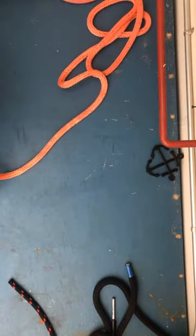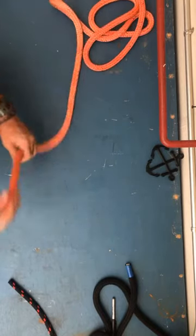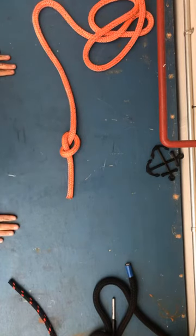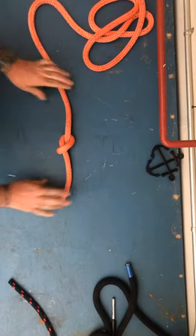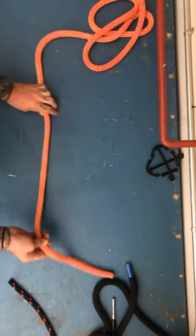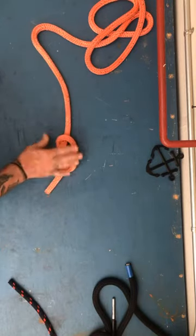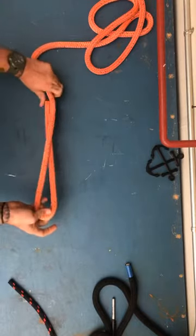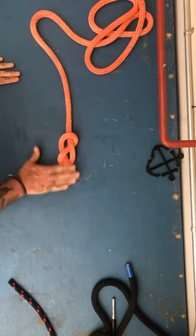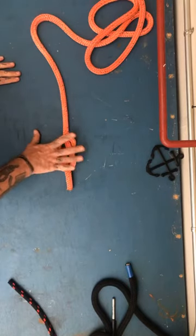The figure eight is a good stopper knot, also good for keeping an end of a line from fraying when you can't melt it or don't have tape. An overhand knot is probably the most common knot but the worst for the line — it breaks the line and is hard to get out; it's a knife knot. If it gets too tight you'll have to cut it out. What you want for a stopper knot is a figure eight: bring it around and it makes a nice figure eight, much easier to get out. Put it at the end of your line or wherever you want to stop it from running through a block or sheave.